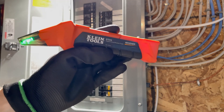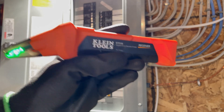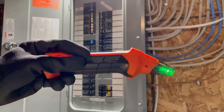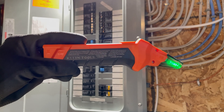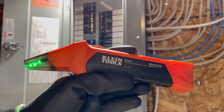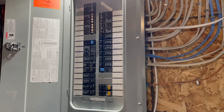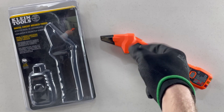You've got to pull it over the wires a couple times and you're not looking for just a couple beeps — you're looking for a real solid tone and a solid red indicator as well. It does take a little bit of practice to get used to what's a false alarm and what isn't, but other than that I'm impressed with this tool. I think it'll be really handy in diagnosing trouble circuits and hard-to-find circuits in homes and other applications. Thanks for watching another video with the Electrical Guide — be sure to like and subscribe.